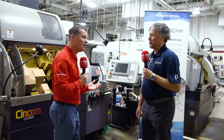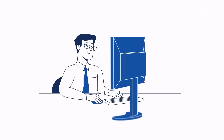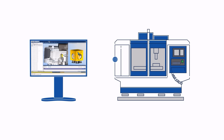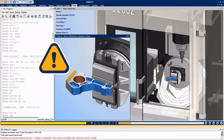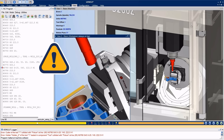Scott, VeriCut — how does it work? VeriCut is a G-code verification tool. Our customers use VeriCut to run G-code programs, macro programs, and prove them out before they get to the shop floor to reduce setup and downtime on their machines. From there, collision detection — collision avoidance on your machine. And then the next step is optimization: taking that G-code program with one single feed rate and putting in multiple feed rates on more lines in order to reduce cycle time and improve tool life.